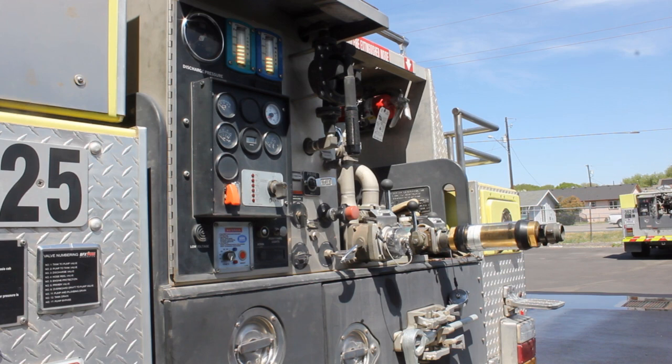If you wanted to take your pump test a step farther, the other thing I really like to do is a dry vacuum test to see if you can hold a dry vacuum. I know I can see that you have some vacuum leaks. I can see water dripping from places it probably shouldn't. So I know that there's some issues in here, but that's okay. It'd be interesting to know if you could pass a dry vacuum test. That's drain all the water out, every bit of it, and pull your primer, pull 22 inches of vacuum, and it should hold that for 5 minutes. You can lose 10 inches in 5 minutes and still pass. But really, if I'm losing anything, I know I have vacuum leaks, so I probably ought to try to fix it.